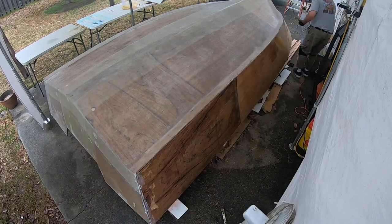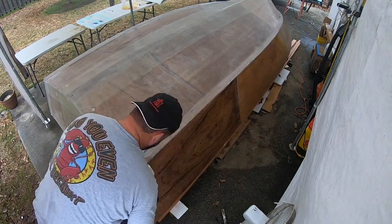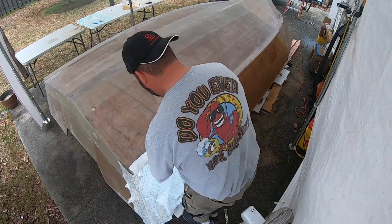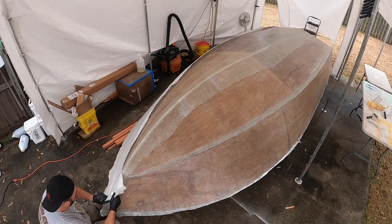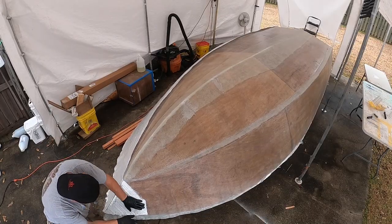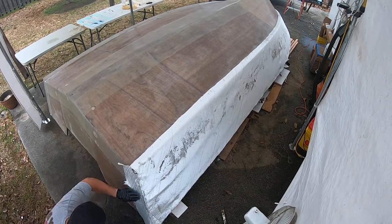Here I'm about to start on the other side - wetting it all out, rolling over it. I'd already rolled on a base coat but I'm hitting it again to make it a little bit easier. I've got all my reference marks. I don't have any idea why I have that big piece laying over here - I should have matched it up with the other side and had it more square. I figured I must have done it for a reason and left it, but I think that's just something I kind of screwed up that I'll have to fair or sand out.